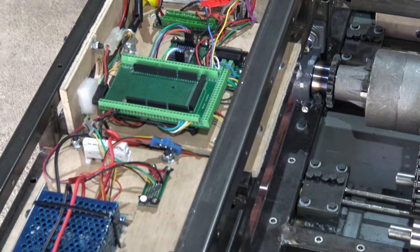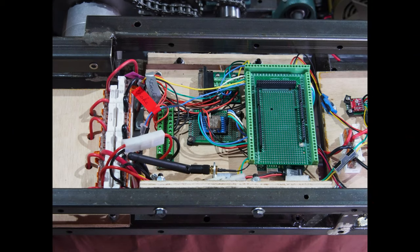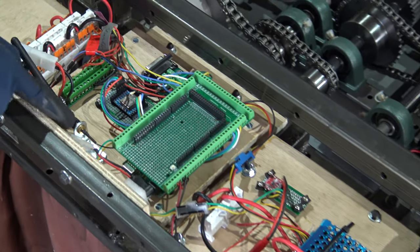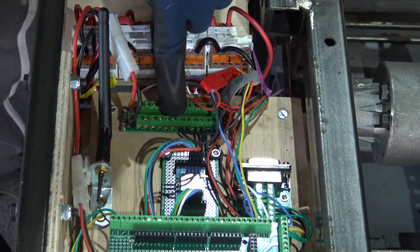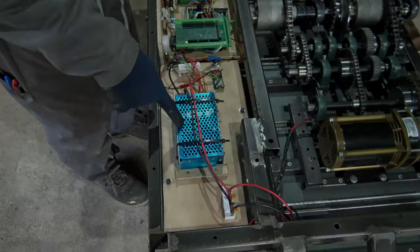Here's the brain of the tank, the main control board. This unit receives the signal from the remote control and translates the commands into signals for the onboard systems. It's made of an Arduino board with a shield right here, a LoRa radio module with its antenna, a VGA connector to easily plug and unplug the gearbox, and a small power distribution unit for the servos. This whole assembly is mounted on 4 silent blocks to reduce vibrations which could damage the electronic components.